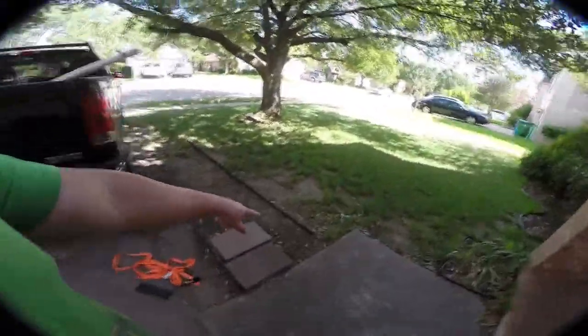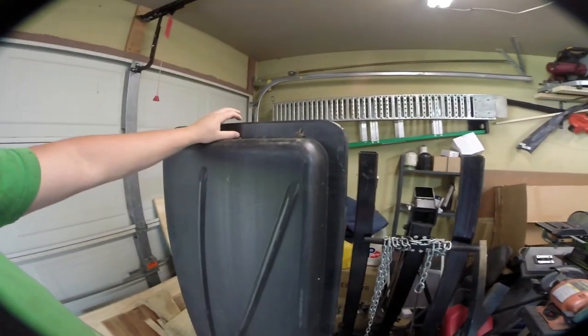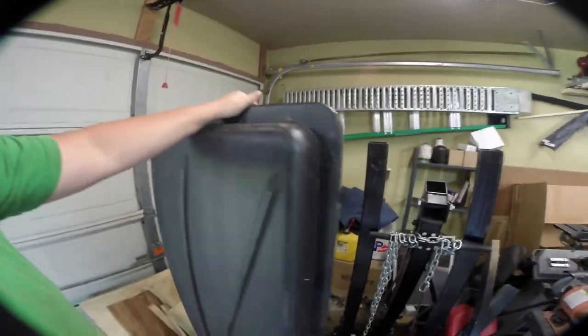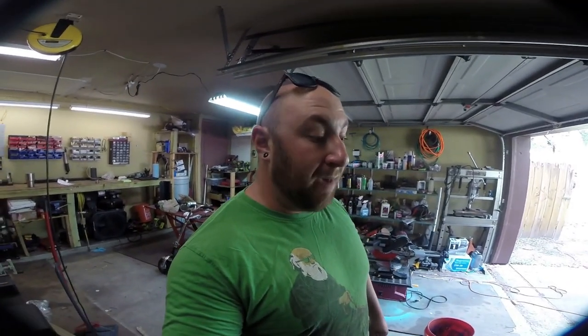But the first thing on today's agenda is to use this. This is 1.5-inch angle iron. And if you follow me back in the garage here, the way these tanks are designed, they actually have a 1.5-inch lip right here all the way around. So we're going to basically build a bed frame, and the tank is going to sit inside the bed frame, and it's going to allow us to mount it to the underside of the box truck the way we did with the propane tank and the battery box. And it's gonna allow us to drop this down a little bit so we can have a little bit of a downward slope from all of our drains to make life a little bit easier.